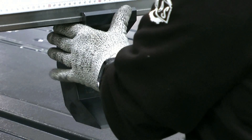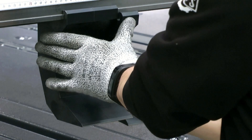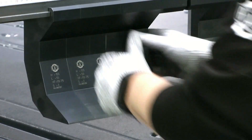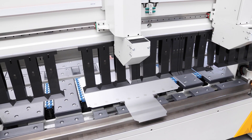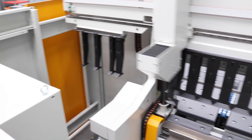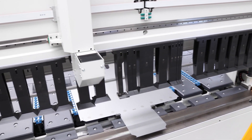For industrial applications, an automatic clamping system is used. The tooling is changed manually and placed into the clamping system. Once the machine is turned on, the tooling is automatically locked. When it comes to small lot sizes or tall and heavy tooling, an automatic tool changer should be considered. The tool change takes place simultaneously as the machine operator prepares and positions the blank.